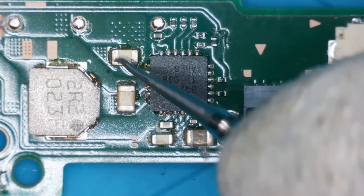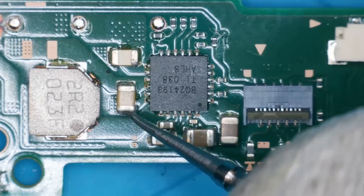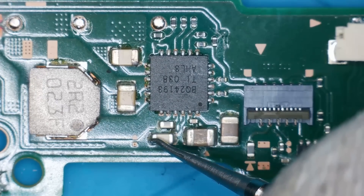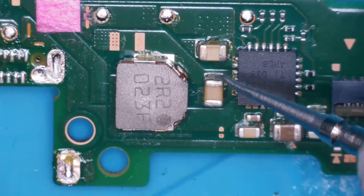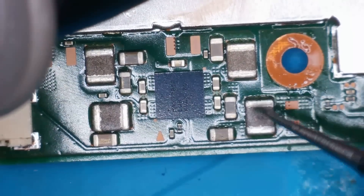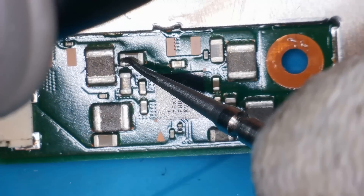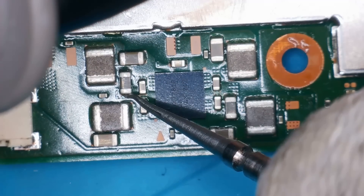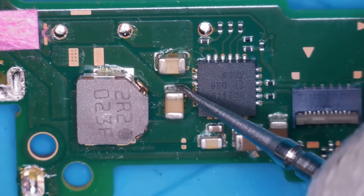BQ's gone. This area here isn't meant to be shorted to ground, and as you can hear, we have a short on this cap. Checking the rest of the components — they all seem fine. I don't know whether that's a shorted BQ or something else on the board. I think Northridge mentioned this cap is usually linked to the Max IC chip over here. Measuring around there — that is a short. That's 14 ohms here, but this cap is coming out at zero ohms on both sides — a short to ground. Zero on that one too, so maybe it's the Max IC that is shorted, which in turn could be causing this cap to be shorted.